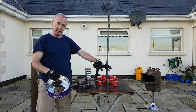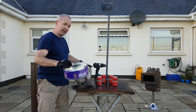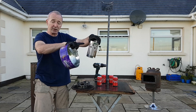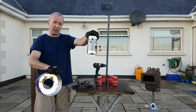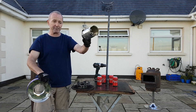So we've got a platform — this is just a sweet tin with a hole in it, and the hole is big enough to accommodate this dog food tin. I drilled holes every one inch, inch and a bit, all the way around. They're 13 millimeter holes and I drilled two rows of them. I'm only going to use the top row of holes at the moment. I also cut two slots just to increase the air and to make it look cool.